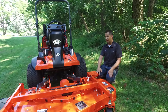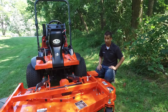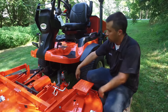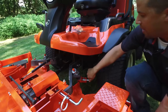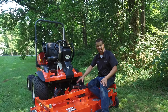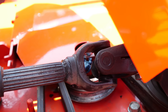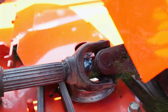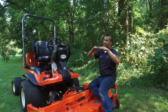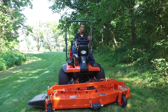This is also a flip-out mower deck. We can use the machine to lift the mower deck up and then use this included handle to stand it up into a forward position. The first thing we want to do is pull the two pins out of the back on these support rods. Lift the mower deck up just a little bit and pull that pin out to release the back of the deck. Once we've pulled our two rear pins, we need to check the angle of our drive shaft. Flip up this cover and look at the U-joint — you want to rotate it so the U-joint is at a position that allows the mower deck to hinge back into the tractor. It needs to be at a 90-degree angle so that it can rotate smoothly; if it's at 45 degrees, the U-joint is going to bind. Once we've done that, we start the machine and lift the mower deck up in the air.